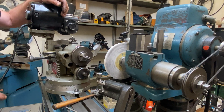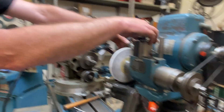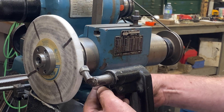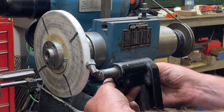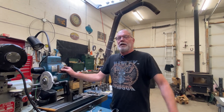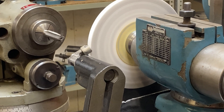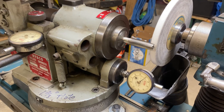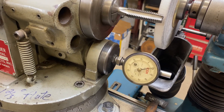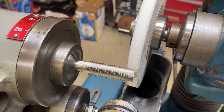I'm going to give my wheel a dressing to get it running true, and then we'll be able to go. Incidentally, this is a 60-grit aluminum oxide wheel. I've got my diamond dresser here, getting it up to center height and tightened up. I have been getting some comments lately — people really upset that I don't use wheel guards on these machines. What can I say, they're right. Always use a wheel guard. Here we are, all set up ready to cut. The wheel's dressed, this dial shows us our axial relief, this dial shows us our radial relief, and both perfectly match what's on the tap.